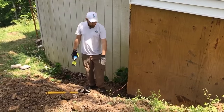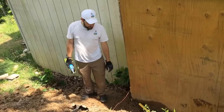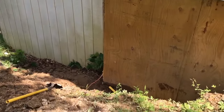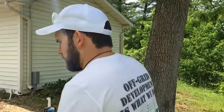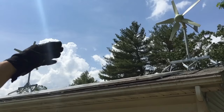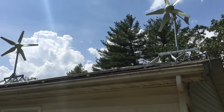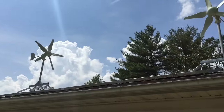That's got everything sealed up there. We put an additional ground rod in to hopefully help the customer out. Should an EMP or anything like that occur, maybe that'll absorb some more of the issue. And that's common bonded now to the Magnums, which inside the Magnum is also bonded to the house ground rod already. What you can see right here is that is the final finish on the turbine. Everything's siliconed — it's got a gasket, silicone gasket up there, silicone at the bottom of the tube mount, silicone at the bottom at the exit, silicone where the wire comes into the shed. The turbines are turned on now where they can generate electricity, and that's got this customer pretty much wrapped up.